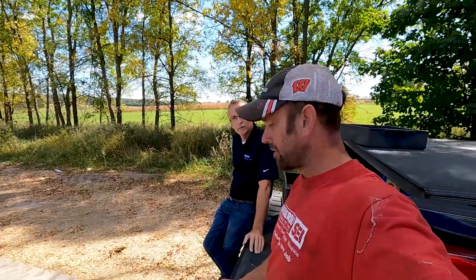We had the chopper lengthen it out. His setting was on 0.75 inch — three quarters of an inch on his length of cut — and he lengthened it out to about 0.79 inches, just a little bit longer. Bill's going to shake it again, but first we're going to talk about moisture. We think we're right around 68% moisture right now.